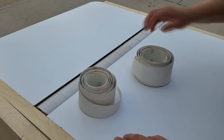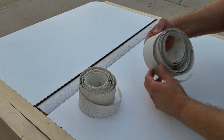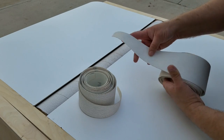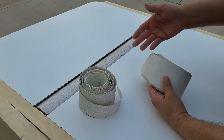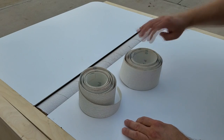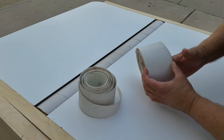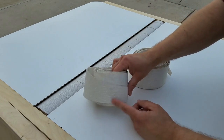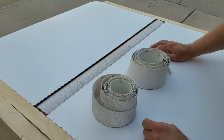It gives us a really nice level flat sand on any part that we put through it. I buy my sandpaper for the drum sander in long rolls — actually very long rolls — and then I cut them myself to the right size. After you've made the first one you can just use the next one as a template, so it's very easy to cut them. These come about three to three and a half inches wide. This is a 220, this is an 80, and I think there's probably a 120 on the machine right now.